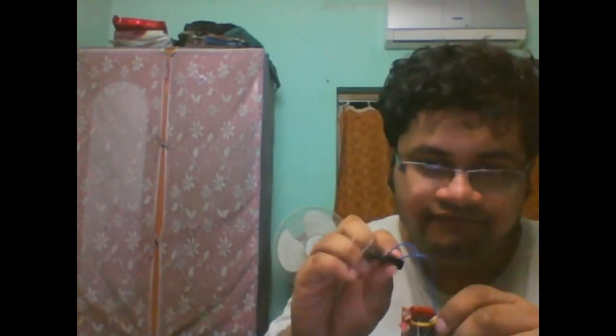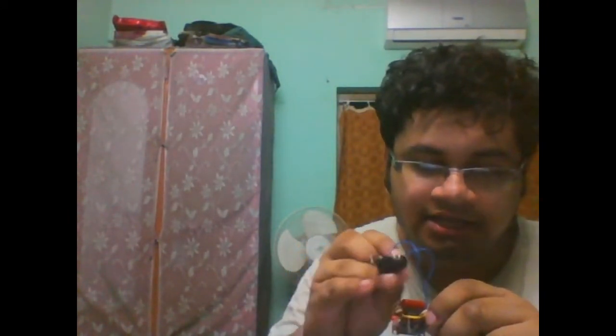The LED is in the center, and you can see there is a parabolic dish around it. Here is a rectifier circuit that I have already created — it is a full rectifier. I will mount it on a board. There are four diodes and a capacitor. It is coming from the mains AC power, converts it into DC, and then it drives the LED.